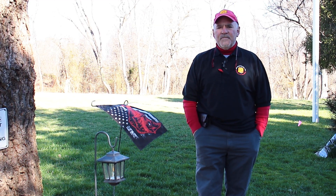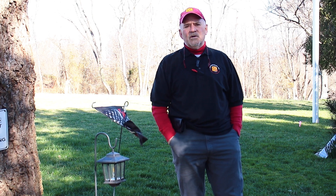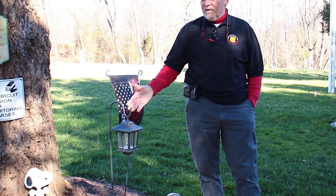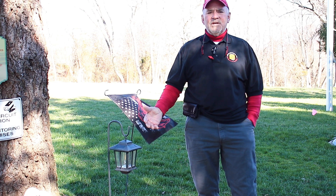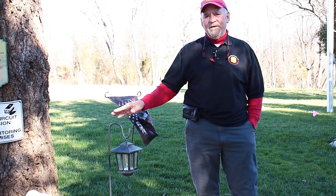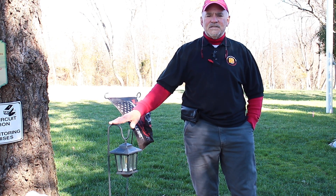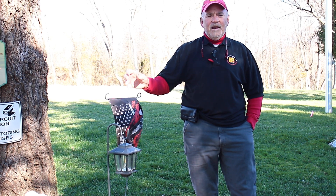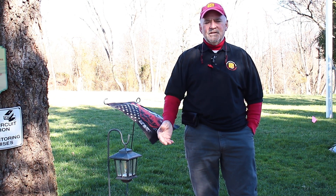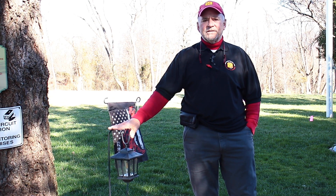I'd like to comment on solar landscape lighting. In the last several years solar landscape lighting has really come a long way. The biggest problem with solar is that in the summertime you have a lot more sun so the lights last a lot longer, but in the wintertime you're going to get maybe about three to four hours on an average fixture. This is a nice option for areas where you don't have access to 120 volts or don't want to trench a long distance to put cable in the ground — a nice feature to complete your landscape design.